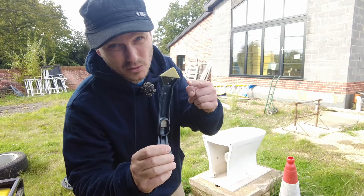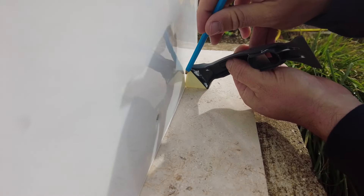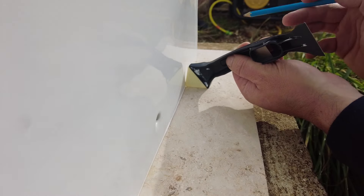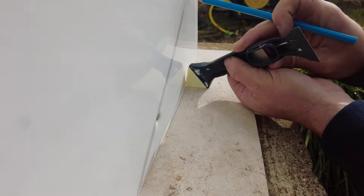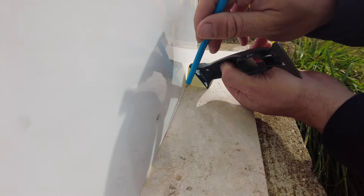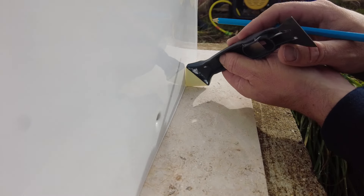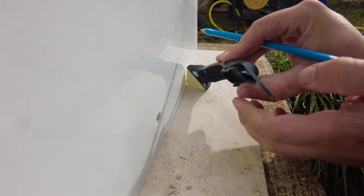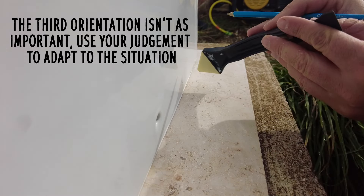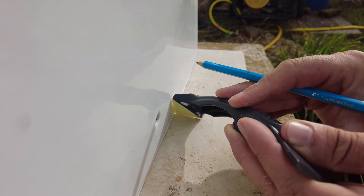Before we get back to the video, I want to explain the correct positioning for your tool. There are three orientations to concentrate on. First: put the tool in so there's a gap at the bottom — that leaves the silicone up on the toilet as opposed to the floor, rather than leaving it on the floor. Second: angle it this way — that means any excess silicone rolls into your actual bead rather than rolling out and leaving a trail. Third: make it flat. So if I do them all in one go — there, there, there, pull.